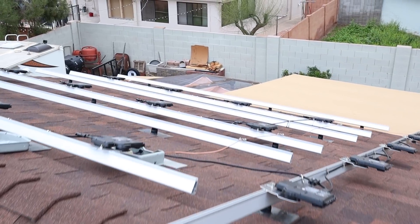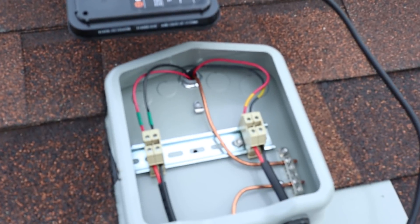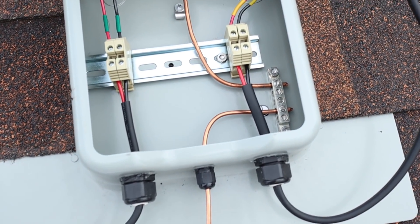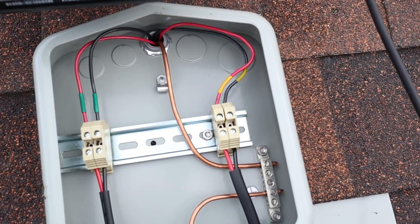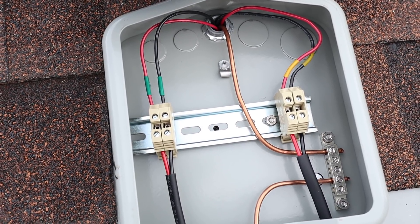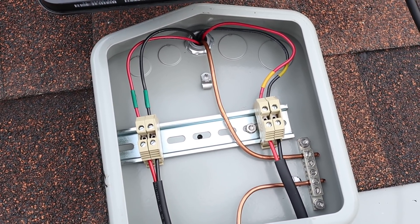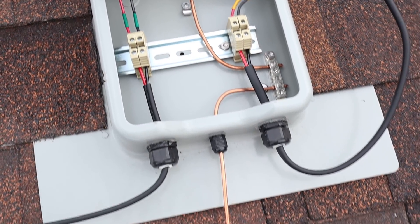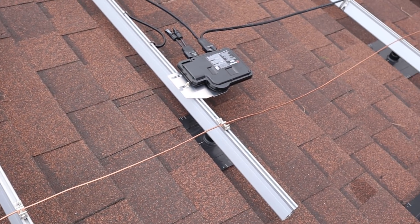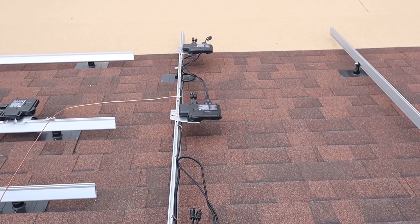Let's show you the other solar deck — on the back side. It's got more going on in there because there's two Q cables coming into it. I have the wires color-coded with some different color electrical tape, which helps me up here and down on the bottom side in the junction box. There's a single ground wire coming out, bonding to the three different sections down here and then running over to the final section right there.